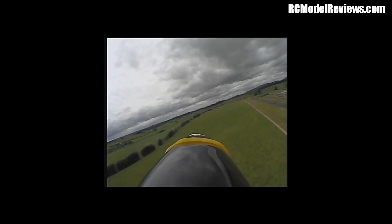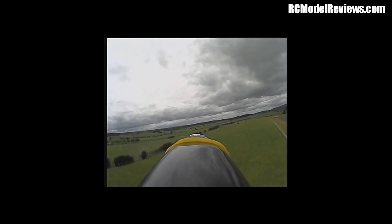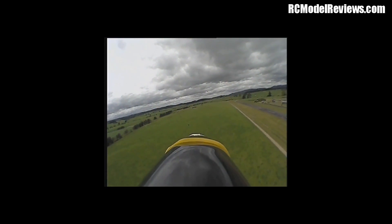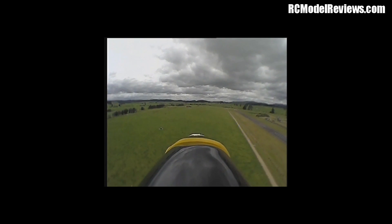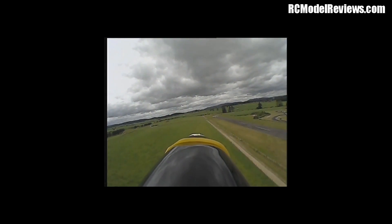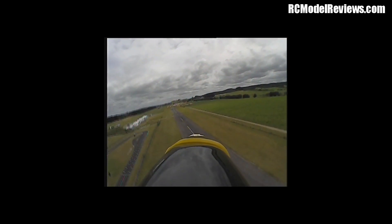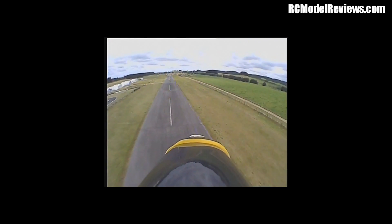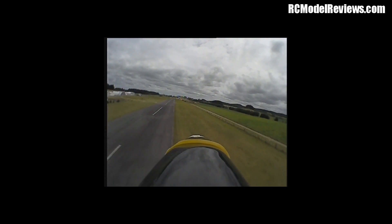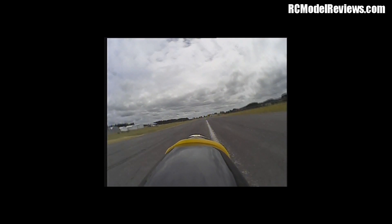As you can see, when the nose is up the ground looks a little bit dark, but when the nose comes down the ground lightens up and you can see all the ground features. It really wasn't a lot different to what I'd expect from one of those CCD cameras, so I was reasonably impressed. I don't usually fly with a 2.1mm lens, but this still has a really good field of view. There's not a lot of horizon curvature when the nose rises, which means it doesn't give you a lot of barrel distortion — quite good for a 2.1mm lens. The 200mW video link is pretty solid: no dropouts, no snow, no real noise.